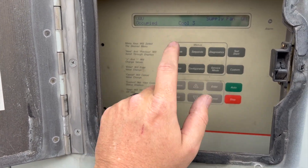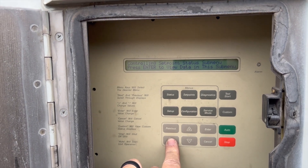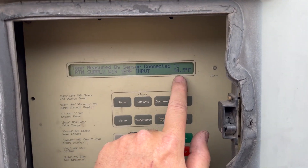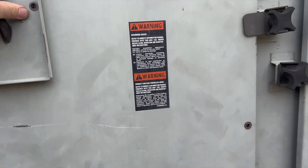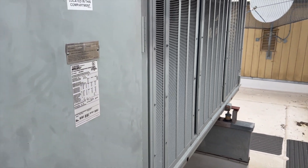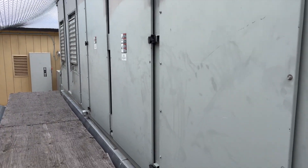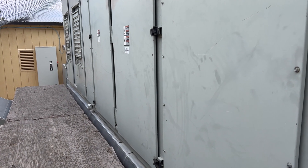In status mode we're going to hit next and check some temperatures. Going to temperature inputs status sub-menu, hit enter. Supply air temperature is 54 degrees — that's looking good. We're going to make a note of that compressor because it sounds terrible and might lock up again, but at least we got them up and running for now. Hopefully this helps — thanks for watching, like and subscribe, hit the bell notification, and follow on Instagram and Facebook.